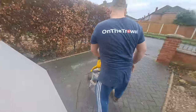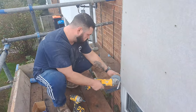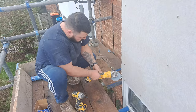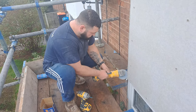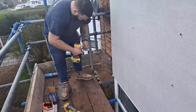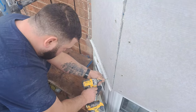We quickly installed the cement boards. Because the cement boards are high alkali, you have to use corrosion resistant screws. I'm about to start base coating soon, so I want to cut the bell cast beads first and get those fixed in position. I do this because I want to build out the bell cast beads with the base coat. The other beads that go up those little splayed corners, I like to bed those in so I can adjust them. I'm also going to bed some render mesh into this — although there are no joints that aren't covered by beads, I still want to play it safe.